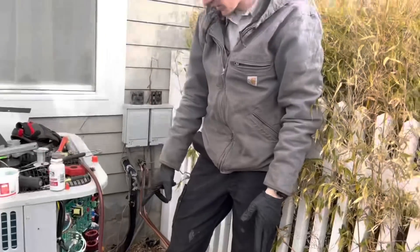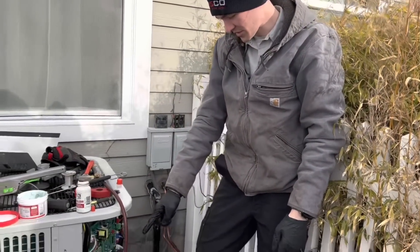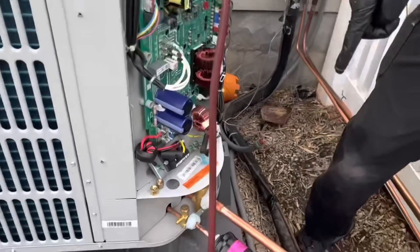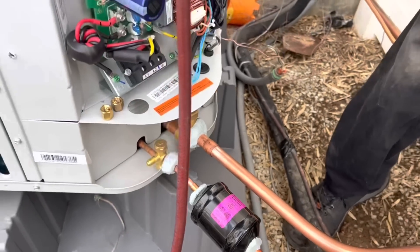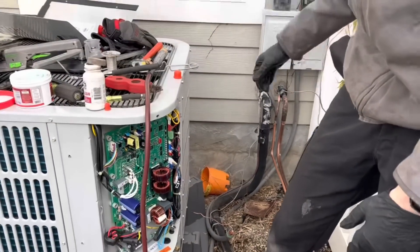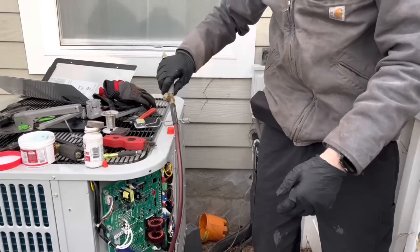Hot block on the king valves, pulled the Schrader cores. Got it on the filter dryer too, so that stays looking good. The steel will stay protected because we won't burn the paint off. The two solders back there were ugly because it was hard to get to.